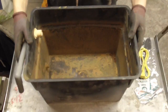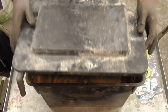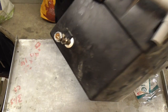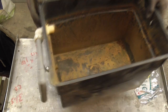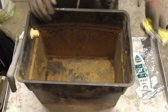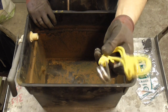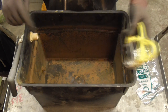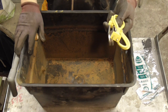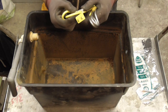So, the hot acid bath. I basically pulled this out of a house I'm helping someone rip out — it's just a cold water tank. I thought it could come in handy, save it from the skip. It comes with a handy lid to stop the children going for a swim, which is always a good idea. I took the copper pipe off the side and put a standard tap on so I can drain it easily. To make it hot, I got the lowest power-rated submersible camping heater I could find on eBay — it's 700 watts. That's quite a low rating for a large volume of water, meaning I don't have to worry about it overheating or boiling. I'll also swap the plug on it.